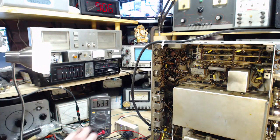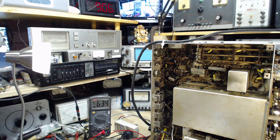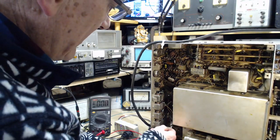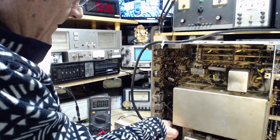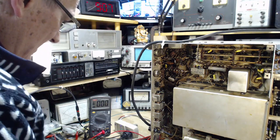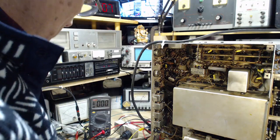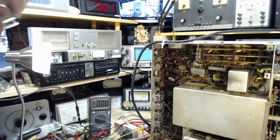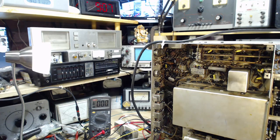What we're looking for is 610 and we're getting 635. The voltage on the plug at this point is 118 volts. That can't possibly explain 51 becoming 71 — this is a small percentage increase. So that test is over. The transformer is not in trouble — it's fine. We need to look at the circuit.